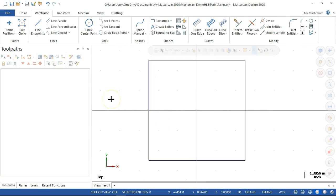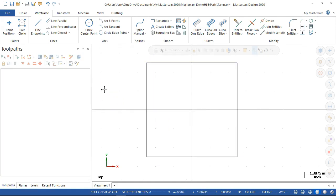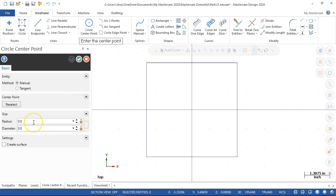All right, so that gives me my starting envelope. The hole locations. So we have a 1.6 and a 1.6 for the small hole. So we'll go to the circle. And then I'll do the 2, and then we'll run through the mirror. We could also do the circular pattern. It's kind of a toss up. One of them is going to make more sense to you. I think mirroring across the axis probably makes more sense unless you have a bolt circle or something where you're wanting to do the transform rotate.